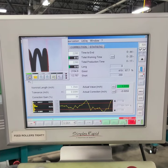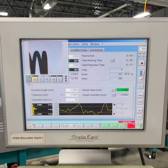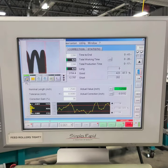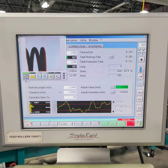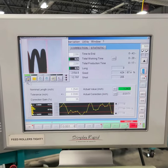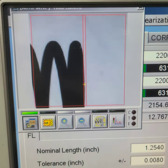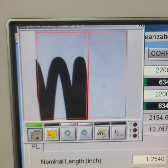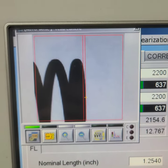Our standard process is to sort two ways. Based on the tolerances for the spring forces, we calculate the appropriate free length tolerance that will produce springs with a consistent amount of spring force along with meeting the print requirements. Prior to the spring being cut off on the coiler, a camera reads the free length of every spring, and the parts that measure within the free length tolerance band go through the sorting chute and enter the stress relief oven.